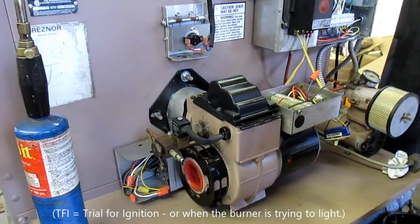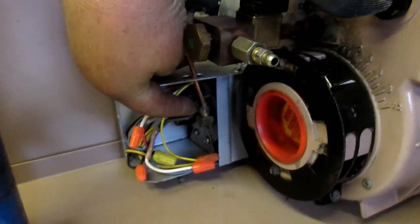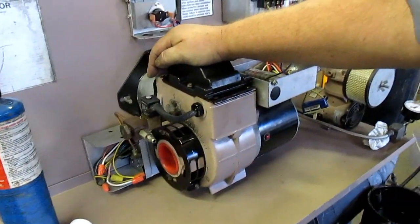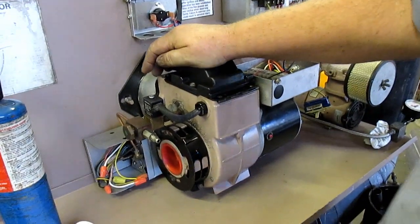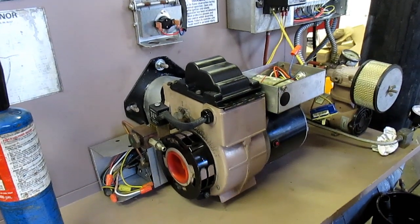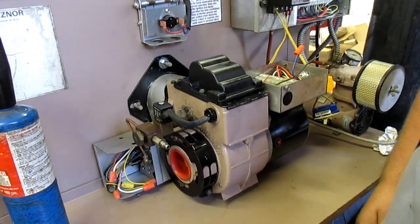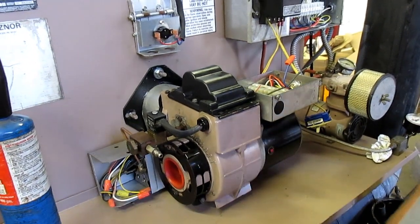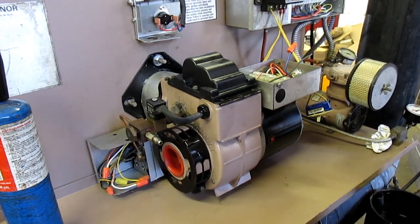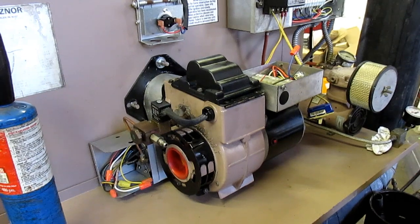On all models, the burner must warm up the oil preheater. The preheater assembly that warms up the oil has to get hot, or the oil won't light and burn. If it still doesn't light, did you use new oil to prime it? If so, new oil has flame retardants in it and doesn't burn. If you primed it with new oil, dump the new oil out of the oil filter and reprime it with used oil.